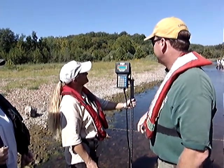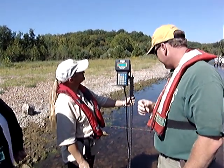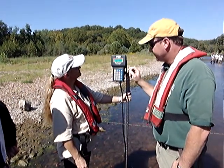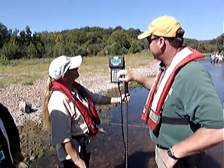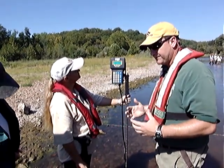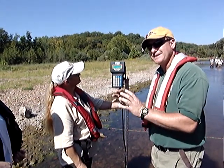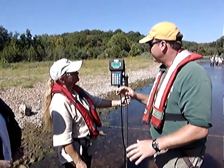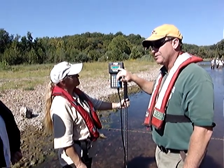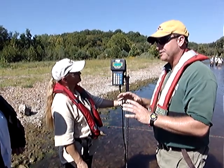And then number six — display raw data. This is the one critical thing that you need to record. SNR-1 and SNR-2 are the acoustic waves going out, and they somewhat pick up turbidity. It's not the turbidity rating, but if the water is very clear, it's a low number — below 10. Those numbers are low, and it's not recommended to make a measurement there.